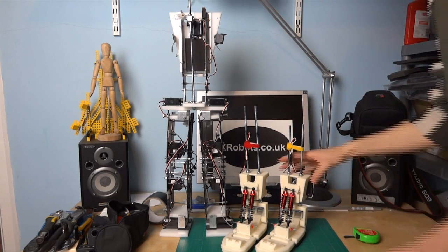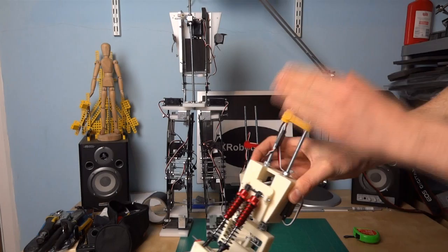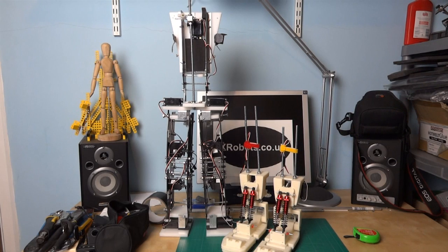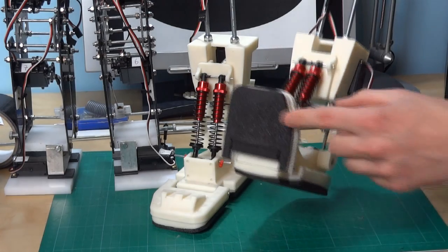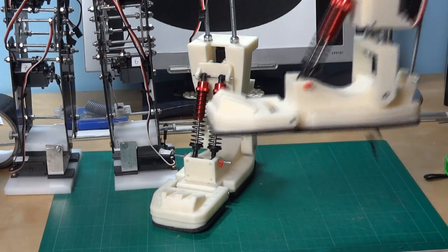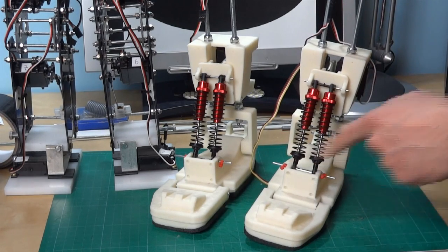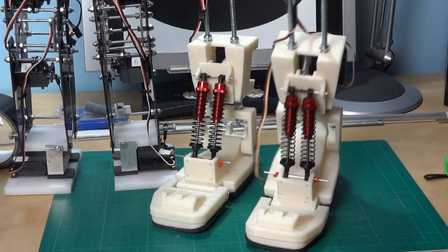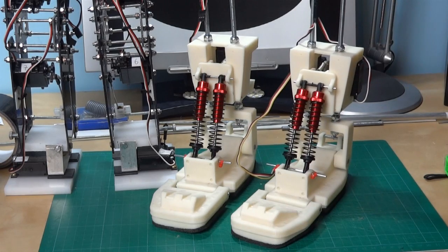The pieces are adjustable on these rods so they can be moved up and down — it can be made taller or shorter depending on how well it works. Its height and mass are going to affect the dynamics of the whole thing. I still have a couple of things to do: I still haven't done anything about the toes. I've stuck a piece of foam underneath there so they don't flip back completely in the opposite direction, but I've still got the mounting points where I need to put some sort of module — might be another active module with a servo, or just an adjustable spring piece, or they might remain passive. Ultimately they really should have springs to help stand upright, otherwise there's no point in having toes at all.